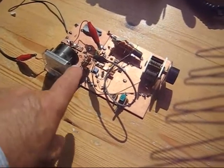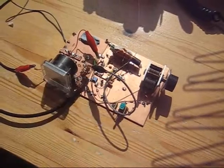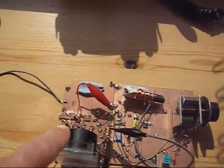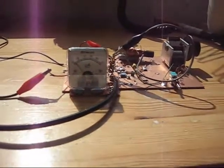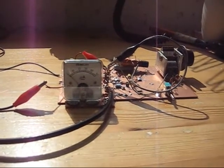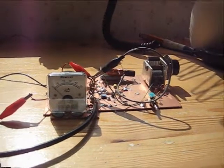Matching is through the little 3C90 toroid with some secondary taps to match into the tuned circuit. Antenna current is measured on a little ferrite toroid just down here. It's reading currently about 3 microamps, which corresponds to about 8 microwatts ERP.